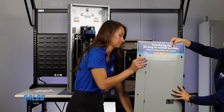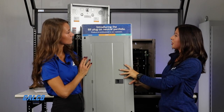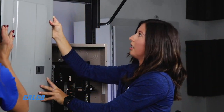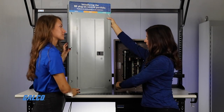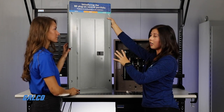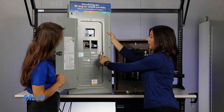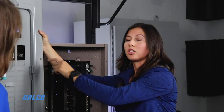There are also several improvements to the cover itself. Now you can hang the cover — instead of having to hold the cover up with your shoulder while you're screwing down, now you can hang it like you would hang a picture. You line it up there, hang it, and then when you're ready, you can screw it in down here. It also has these on the bottom, so in case you're doing a bottom-fed load center, you can also use the hanging cover feature. Inside, we've replaced the circuit numbering stickers with embossed circuit numbering. It will still come with the stickers if that's your preference, but now it's engraved just to save you a step.